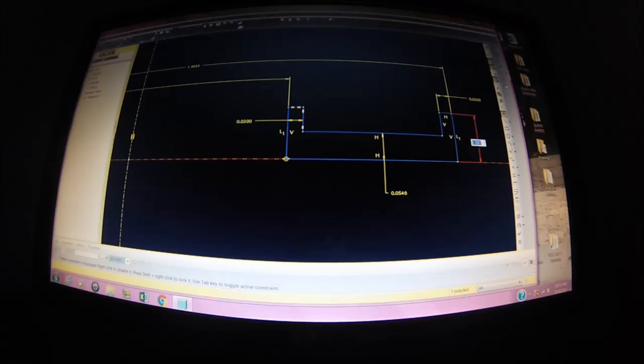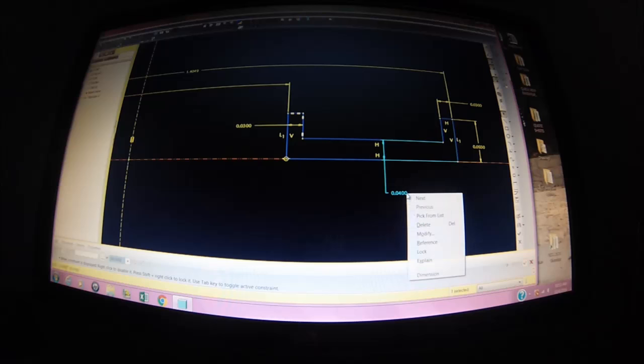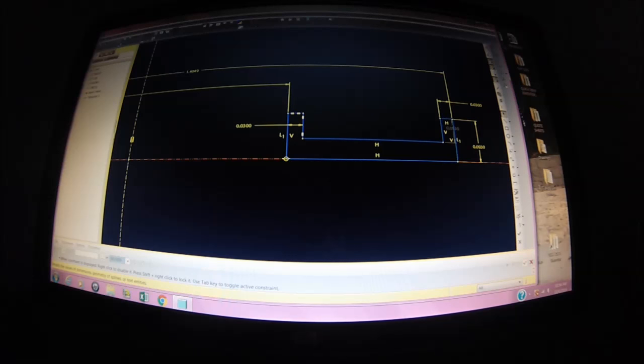The final part was requested at 0.093, so we're going to shrink the height a little bit. And this pocket here, 40 thou. Whoops, excuse me. We're going to have to just say OK on that, delete that dimension, and make the pocket depth 040. All right, now that's much better because no matter how thick the part gets, this 040 pocket will always be 040.